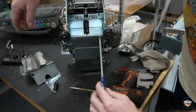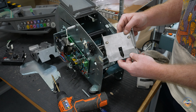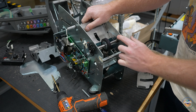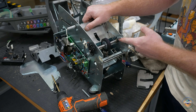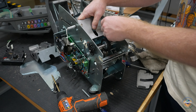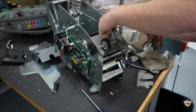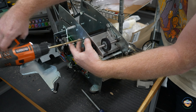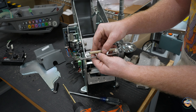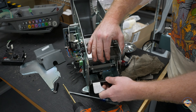Now we're going to start rebuilding the machine. I'm going to start with the lower tape plate — it slides in the back like this. You may have to lift this lever a little bit. What you don't want to do is put it in with this lever all the way up, because that brings these wheels together and you're going to fight to get it through. So only lift a little bit if you need to get it around, then put it in place. Before you put this plate in, you want to line this lower tape plate up with where you're going to put the shaft and the felt pad. You'll see that shaft can go in. Now we're going to put our baffle safety plate back.